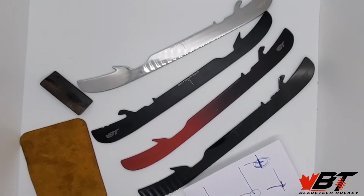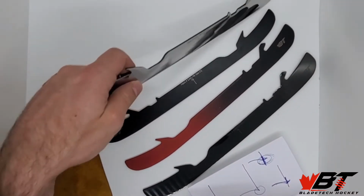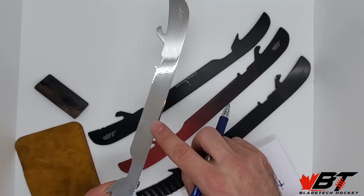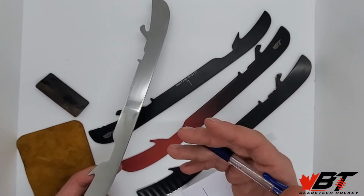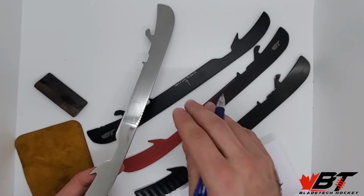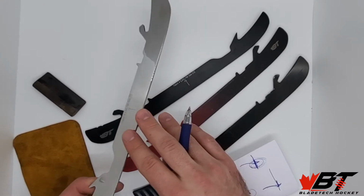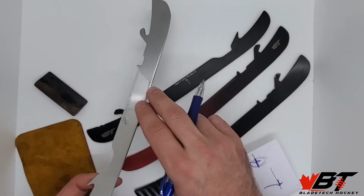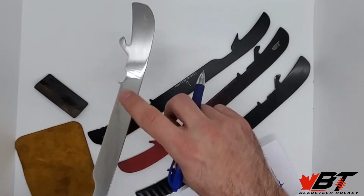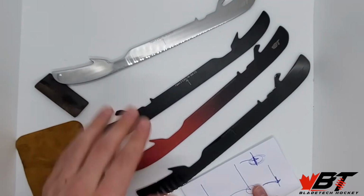There's no right or wrong way exactly, but the better way to do it would be, imagine you're trying to take a piece of normal steel and put a mirror polish into the steel. You can't, for example, just use 80 grit sandpaper and then grab 500 grit sandpaper and expect to find a mirror polish. Instead, what you're going to need to do is use the 80, then a 120, then a 240, then a 300, then a 500 grit, then put a little bit of lubricant and use a very fine grit or a wool. And that's how you're going to polish something.